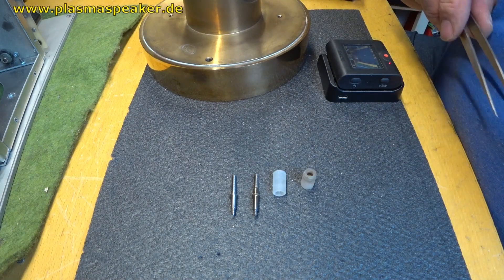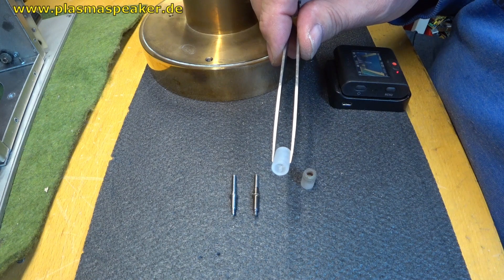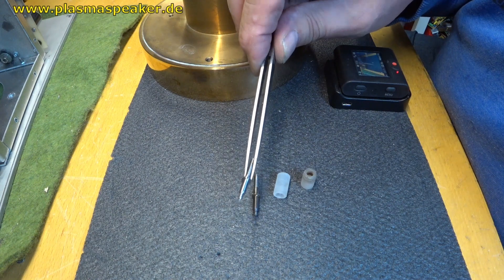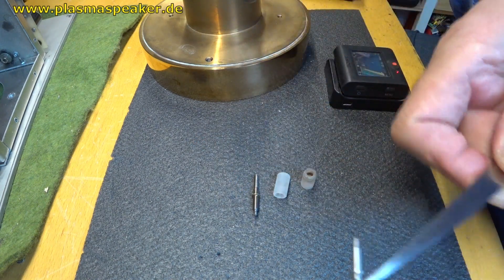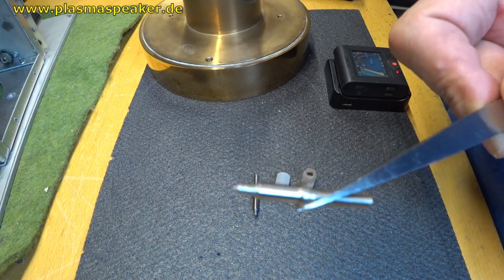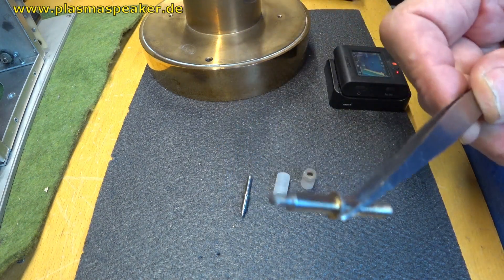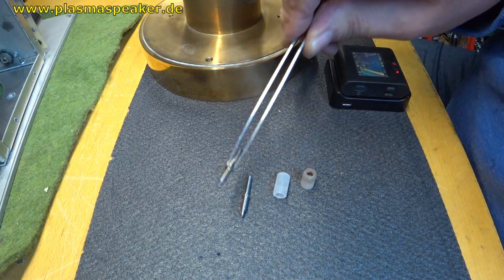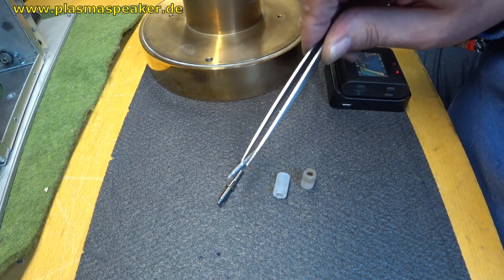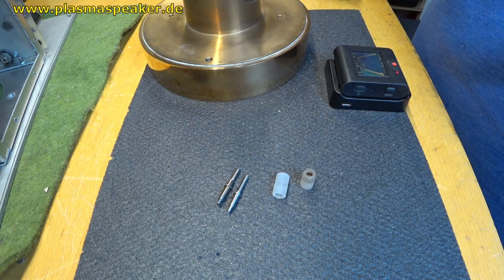Now for comparison, here are the old parts and the new parts. This is the new quartz cell, and here is the new electrode which I have manufactured. You can see there is a nice sharp tip. This was the old one — the tip is burned away — and here we have a nice sharp tip. Now we will mount it together.